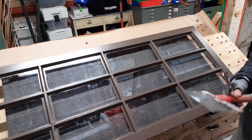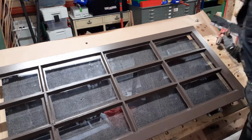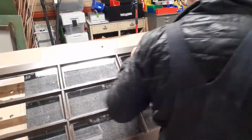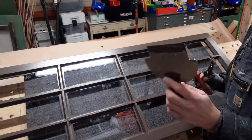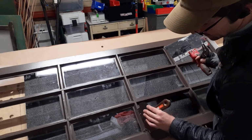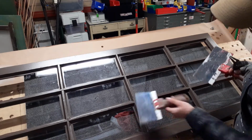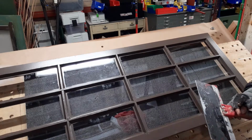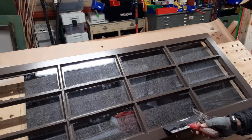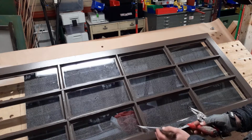Another thing that I would like to show you is, where's my custom paint cutter tool? There it is. I'm going to go in front of the camera real quick. Hang on a sec. All right, I bumped the tripod. I took a normal taping knife and I ground it down to have a much more narrow area of cutting the paint. In fact, this one might be the ticket. Too wide, obviously. You go another size down, it's close, but it's hitting the putty. You don't want to do that. So I'm looking at the combo. Usually I use 2 in these situations, and that's pretty good. I like using this guy because I'm still going to be dressing up corners, so it's not as critical that I go one that's perfectly all the way across.